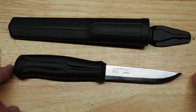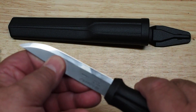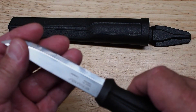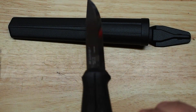The high carbon steel that Mora uses in their knives has a one percent carbon content, which puts it in the class of steels similar to 1095 — a very popular high carbon knife steel. These are nicely and properly hardened, they will hold an edge well, they've got a very acute edge angle so they get very sharp, and yet they're pretty easy to sharpen.